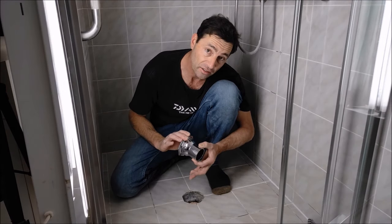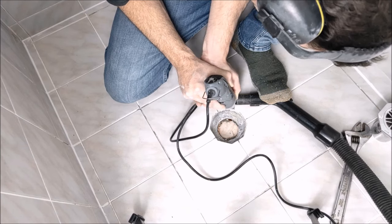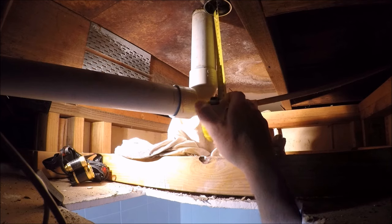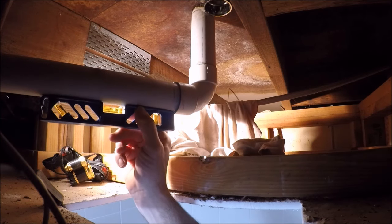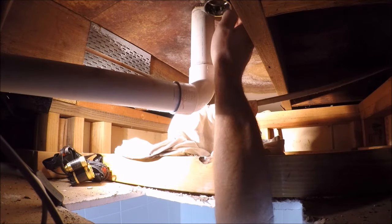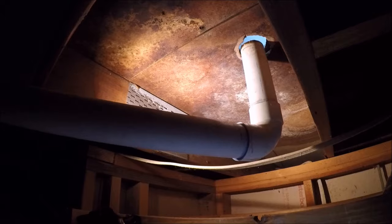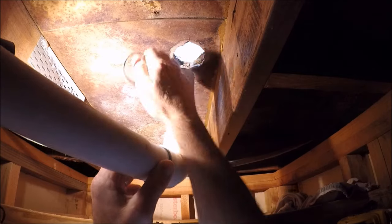The first job is to change the shower pan waste for a new one. It's slightly bigger so the mortar needs to be cut out a bit to fit the replacement waste outlet. I used a Dremel tool to cut out the mortar and also cleaned up the remaining silicone and grout. I'm checking that when the plumbing gets reconnected to the new floor waste we still have fall on the plumbing so water can escape. We need to trim about 10mm off the top of the pipe to accommodate the slightly bigger floor waste, then cleaned up the end of the pipe with sandpaper.